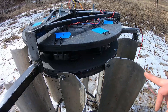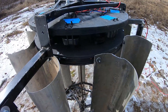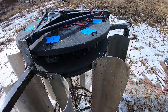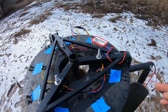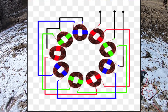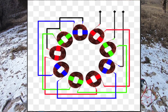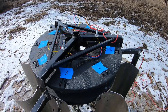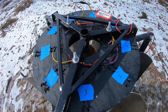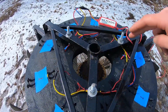Each coil is wrapped in electrical tape with some output wires. Remember to mark on your output wires which wire goes from the center of the coil and which side is the outside, because there's an important note when wiring it together in three-phase. Essentially, you're wiring together three groups of coils in series, then wiring those series together at one end, and having three outputs go into your AC rectifier. This is one way of doing a three-phase connection — I believe this is called a star connection. The nine coils are: one, two, three — one, two, three — one, two, three, with each first phase situated 120 degrees apart, second phase 120 degrees apart, third phase also 120 degrees apart.